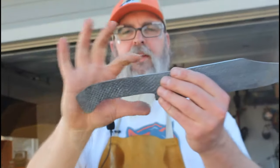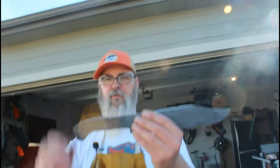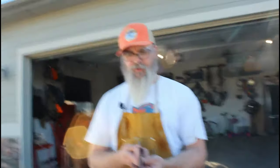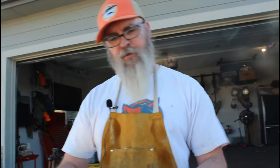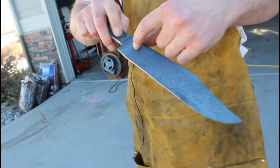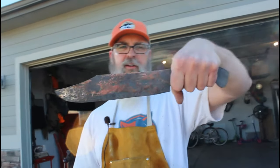I think my challenge is going to be, I'll have to get a pretty solid piece of wood, scales that go all the way through there to make that in place. But overall, it ended up not being too thin. I just have to be a little bit careful when I'm grinding and quenching, and then we'll see how much of this scale can come off. But it might end up where the top part of the blade has almost like a scaled finish to it, just showing that it was made out of an old rasp. But overall, pretty good, nice chopper.